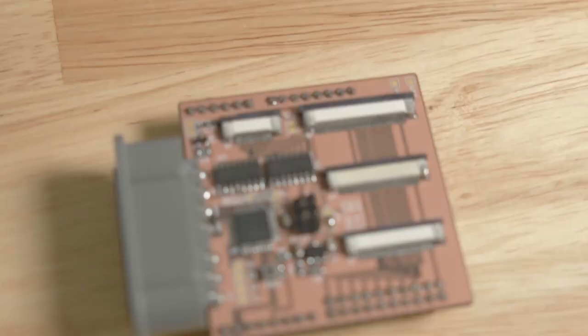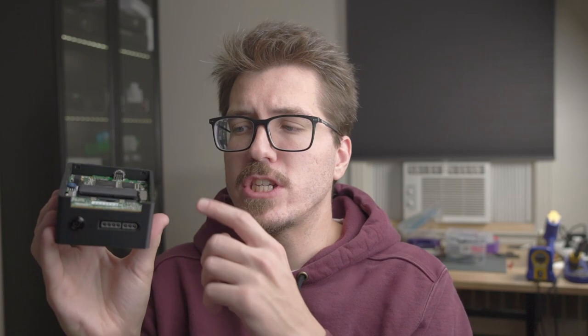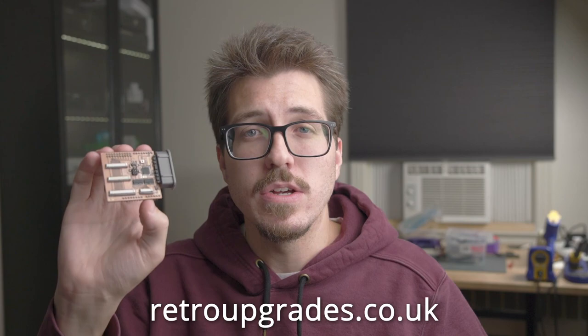In this video, I'm going to take you through every step of completing this project from start to finish. I want to be upfront and say that at the time most of this video was recorded, one of the main components of this build — this shield developed by ManCloud — was not available from any mod sellers. So the majority of this video is going to show you how to put one together yourself, from ordering the board on Oshpark to hand soldering all the components. The first time I got my GBA HD together, I was having problems with buttons being really laggy — like one or two seconds of latency — most likely due to a fake microcontroller I ordered. A big shout out to Retro Upgrades, who created a batch of these shields and sent me one. With their shield, I was able to finish my GBA HD and that latency was gone.